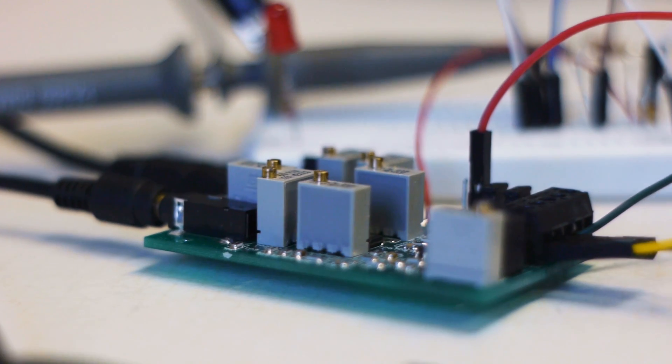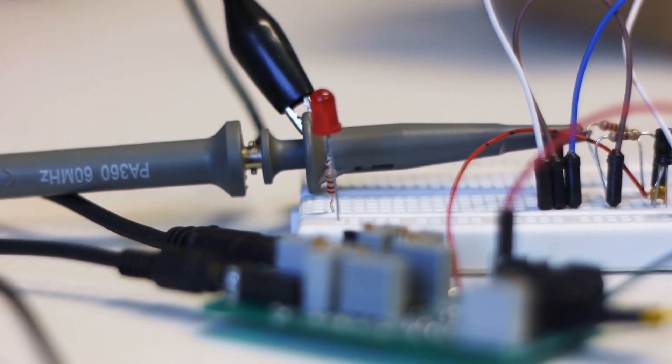The one we called 1.5 would print but it had problems turning on the laser. We spent some time trying to figure out what was going on. These lasers at 20 milliwatts draw about 60 milliamps, and that should be no problem turning on a 60 milliamp signal with the most basic of transistors, but it just wasn't working. We tried a few different FETs, and finally I threw a 42-amp FET from my bin on there and it turned on the laser.